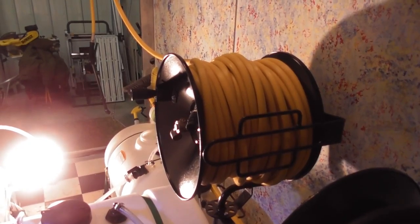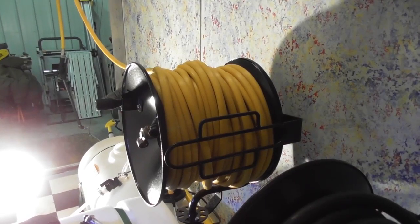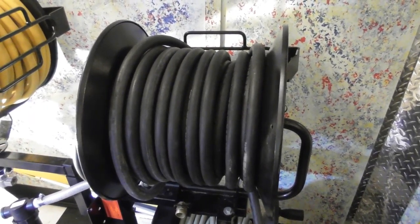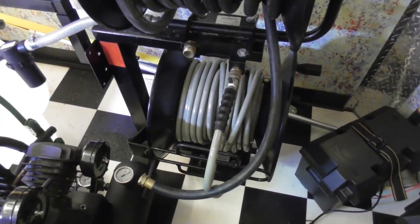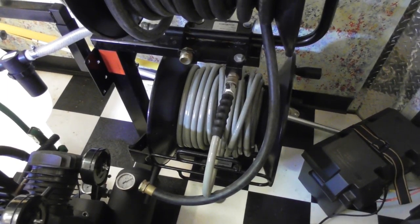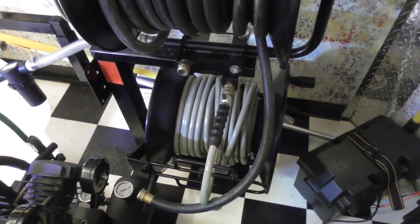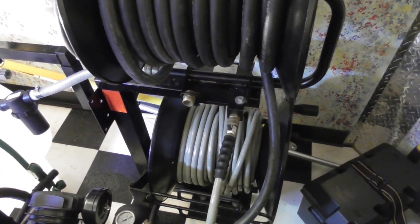However, if I'm doing chemical work, depending on how my trailer is set up, that hose can either go out the back or out this door. Typically that's about 100 foot of hose right there. I carry another 50 foot — that's the garden hose. So I park within 100 foot of the hose bib at the house. That's 100 foot of drain cleaning hose. It has a really smooth surface, but I can use it for pressure washing as well — but you can't use pressure washer hose down a drain. That's 100 foot, and then I carry two more 50 foot hoses and one more 25 foot.